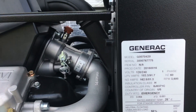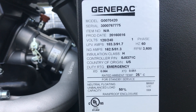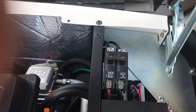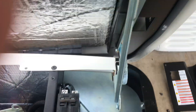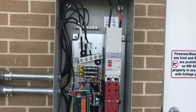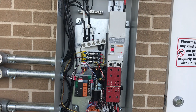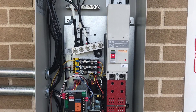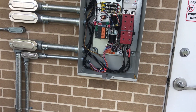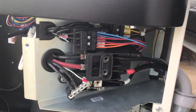This is a single-phase system. We've got a 100-amp breaker, a 200-amp transfer switch, and number three wire running to it. The 200-amp is basically just a disconnect. We've got a 60-amp breaker on the opposite side upstream to protect the wire. The wiring is straightforward — color to color, basically from the transfer switch to the generator — we didn't have any problems wiring it up.